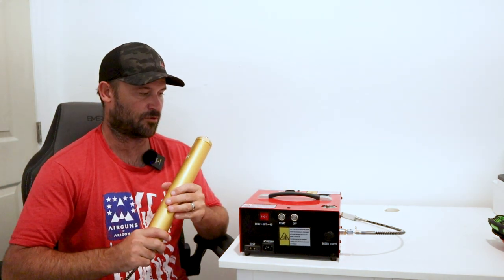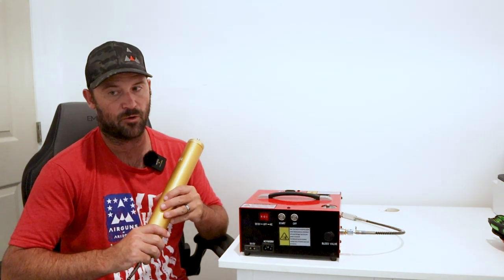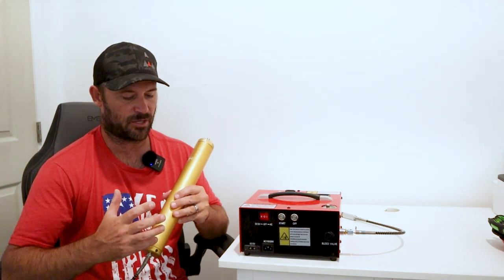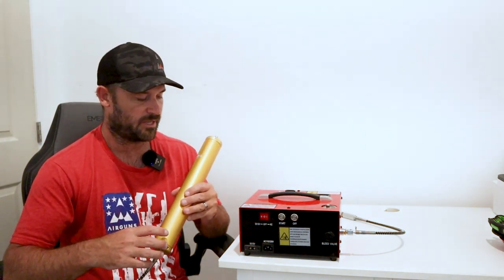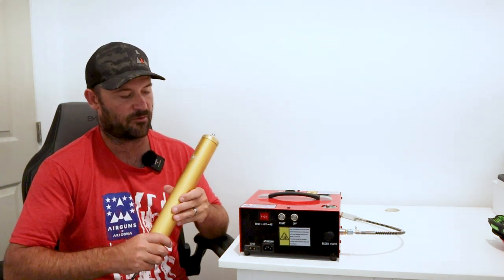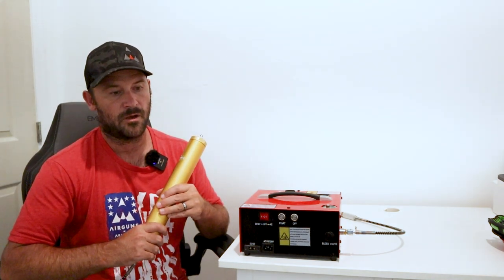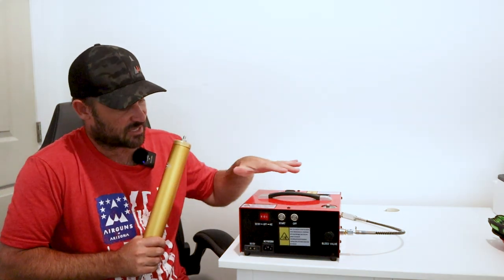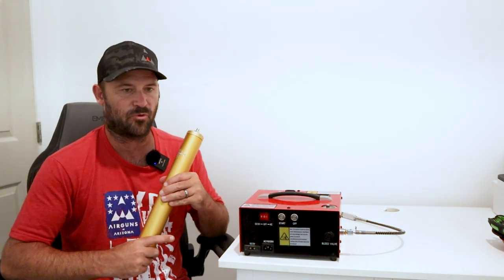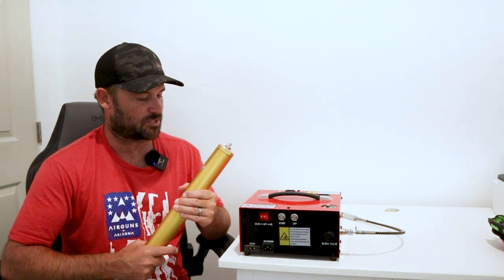So now we've come full circle on why it's worthwhile to save your money for an Omega or a Daystate compressor — because they can fill the volume necessary in one fill to pressurize a large filter as well as a bottle or a gun without stopping and going, because they're usually water-cooled and oil-lubed versus this unit, which is air-cooled. One is just intrinsically much more reliable, and that's the water-cooled and oil-lubed compressors.